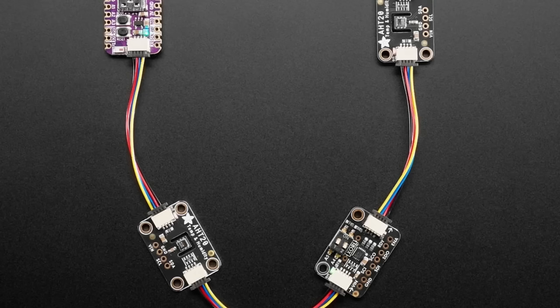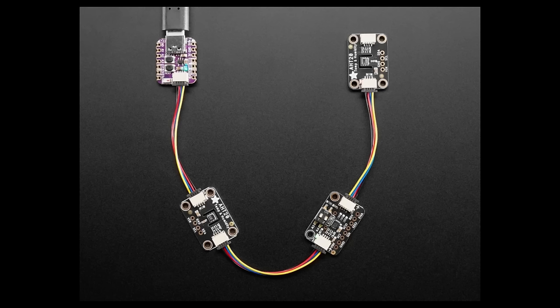Here's a little example showing a QT Py board with a STEMMA QT I2C output. It connects to an AHT20 (a fixed-address temperature/humidity sensor), then to the translator, then another AHT20. The controller sees one at address 0x38 and the other through the translator at 0x58 because a couple of bits have been flipped. It's very transparent to the controller — you don't need a multiplexer or expander where you'd have to switch between them.